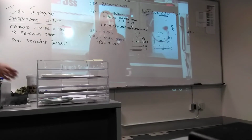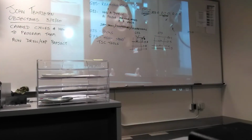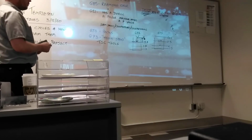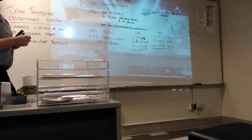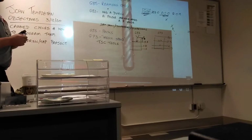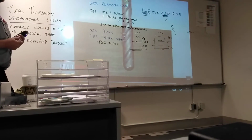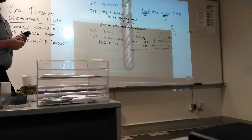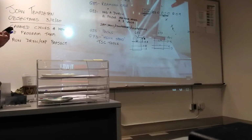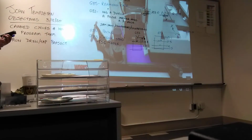Learning how the Haas through spindle coolant, or TSC, system works. Through spindle coolant is typically used to remove chips from holes while drilling or tapping. Traditional flood coolant has a difficult time getting into holes and removing chips, especially if the holes get deeper relative to their diameter. When chips are left in the bottom of a hole, your tool is constantly in contact with these chips. These chips can make the hole oversized, can ruin surface finish, and can wear your tool out prematurely. Not only that, without TSC, you'll be doing lots of peck drilling, which increases cycle time every time you drill a hole. Let's look at how Haas does TSC.